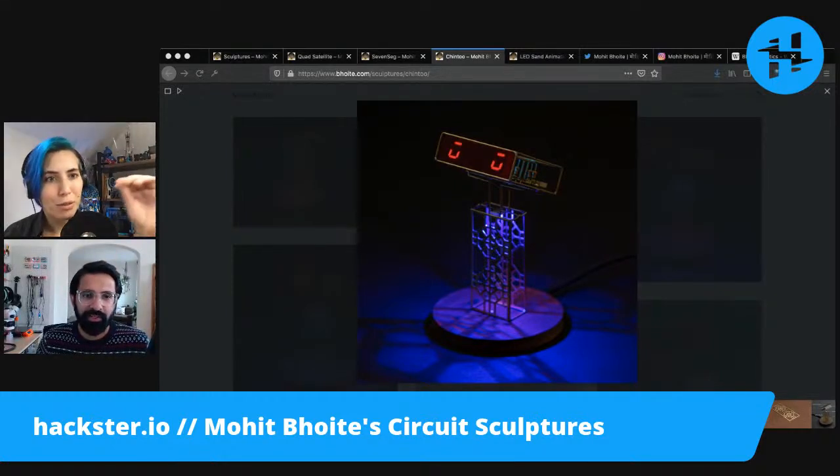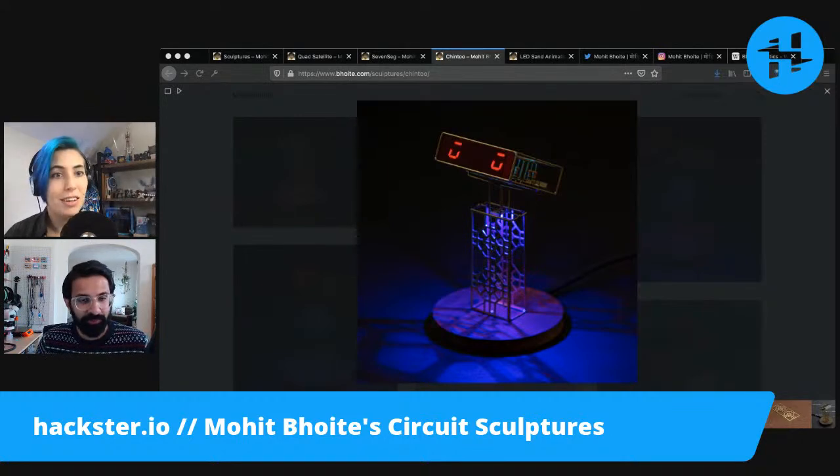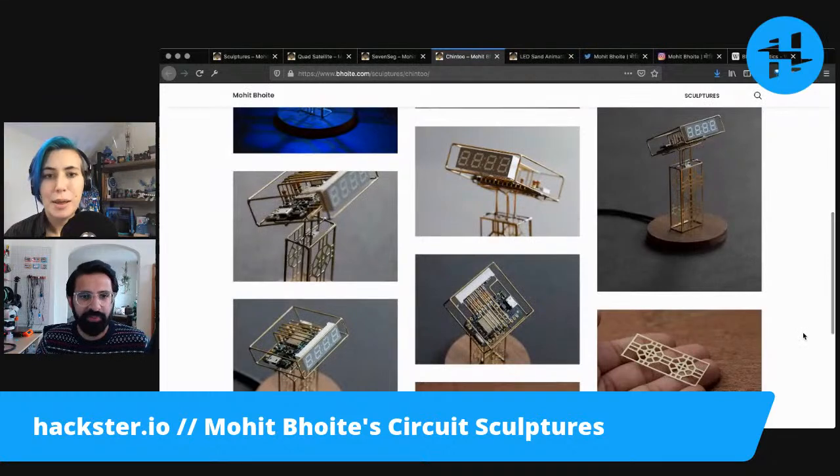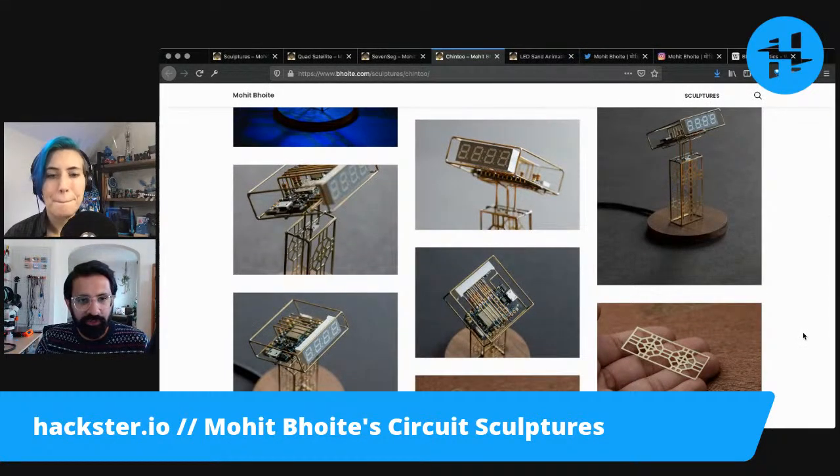Can you etch all the way through it with just an etchant? Yeah, the sheet has to be thin enough, but that gives you an extremely high resolution in what you want to etch. It's almost like making a PCB, but with brass instead of copper.